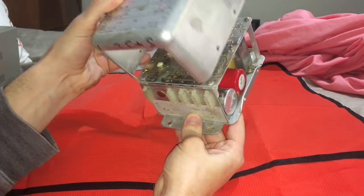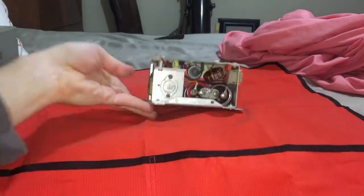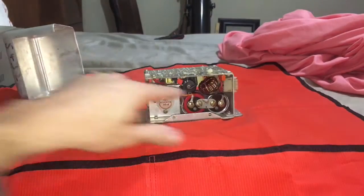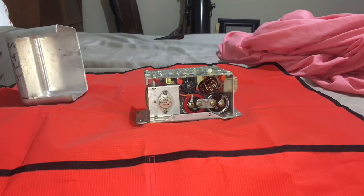So what we're going to do is talk a little bit about what was wrong with this one. You can see on the inside of the case there was some leakage. The capacitor was dried out — one of these was leaking.